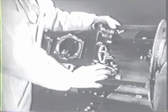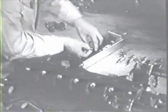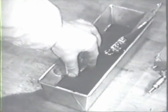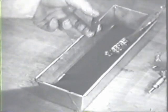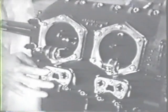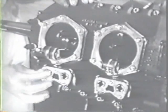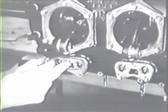Now you can remove the connections that you use to hold the tappets in place and rotate the engine to a position convenient for installing the hydraulic plungers. Dip the plungers in oil and pump them several times to remove the air and fill them with oil. Insert the units, tube end first, in the cam follower body. Then insert the tappet cups. The units have all been installed.